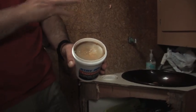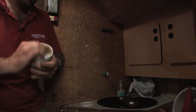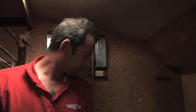This stuff - Stay Afloat - which I've seen advertised in the US. What you're supposed to do is grab a handful of it, smack it over the broken seacock. Well, that's worked well as well. It'd be nice to see how it works under a bit more pressure, but that's stopped it completely. Being so greasy and amorphous, it doesn't much matter what the shape is.